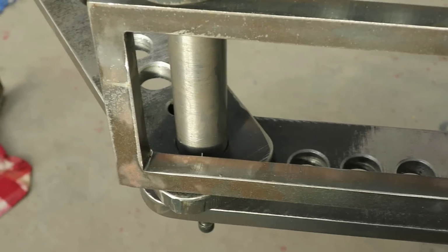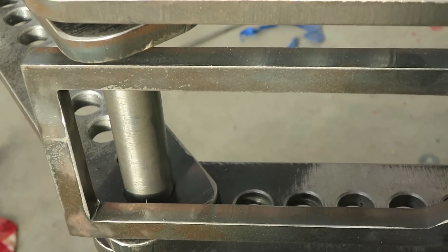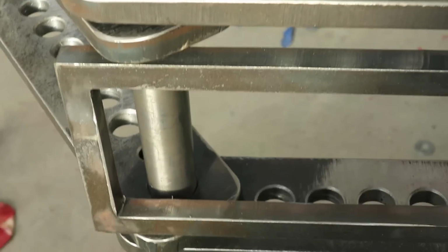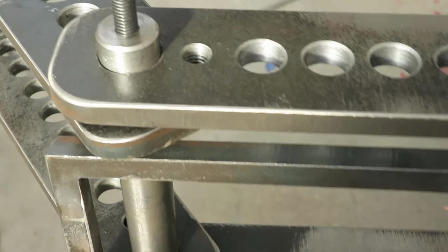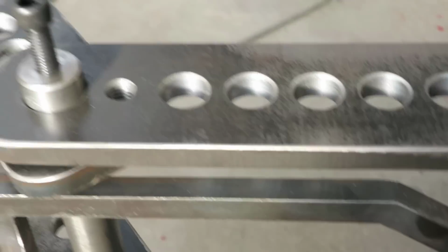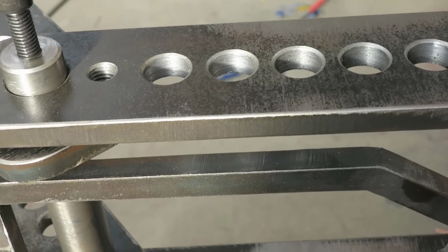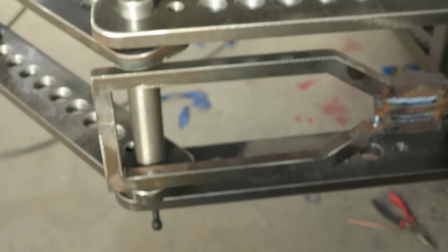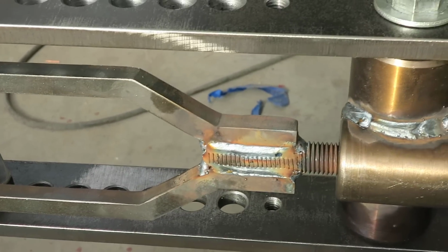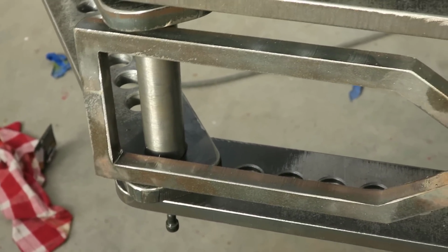But anyway, normally you just take a piece of 1/2-inch flat iron, and if you've got a 4-inch tube, and say you're using 1/2-inch bolts, drill your holes at 4.5 inches, make 2 plates, put one on the bottom, top, or however they're oriented, and you run bolts through them instead of the U-bolt. It's just a quick way to get you back on the road, and in some instances it's a lot stronger than the U-bolt. So well, that's one more piece down.